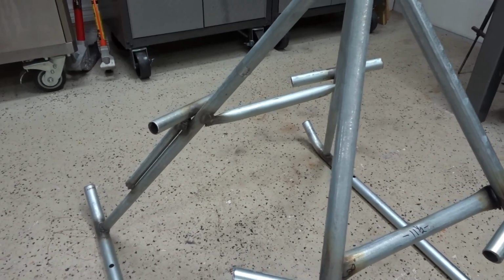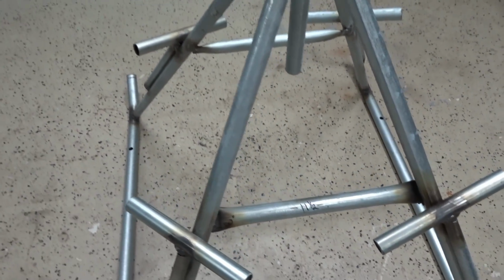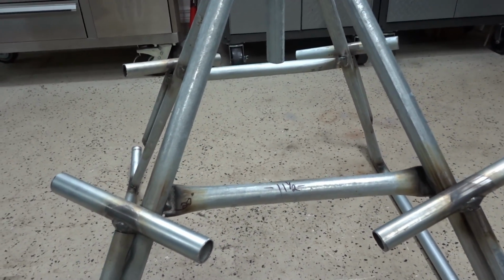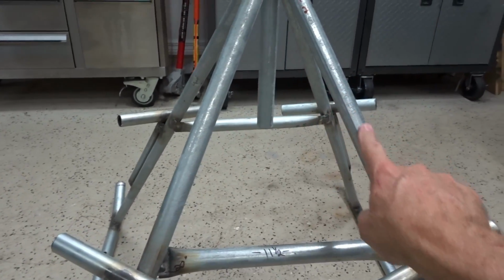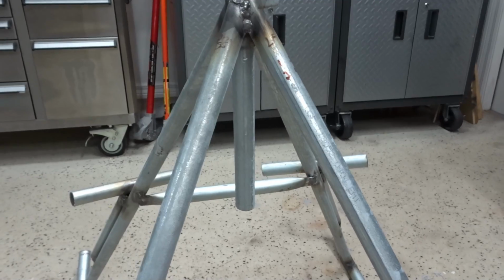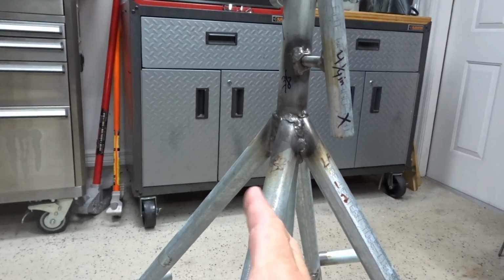I don't think it'll be completely hog proof, but I'm working on a hog proof sled for trail cameras, so stay tuned on that. But these will be nice and secure, I believe. So these 4 corner posts are 36 inches long. Again, they're 3/4 inch piping, and all of these angles up here are cut at 55 degrees.